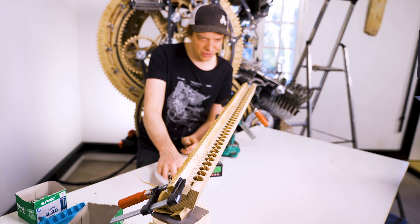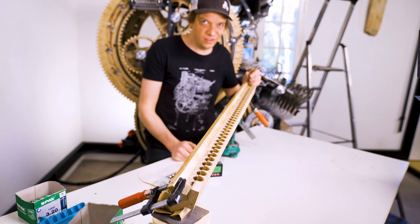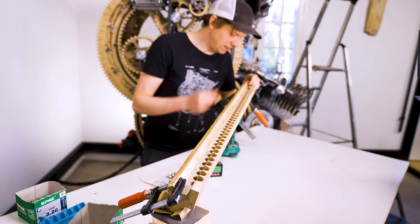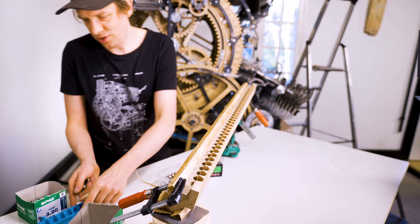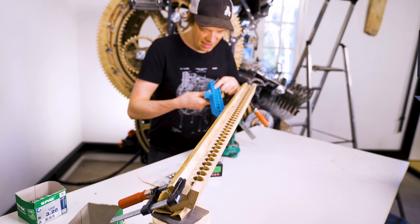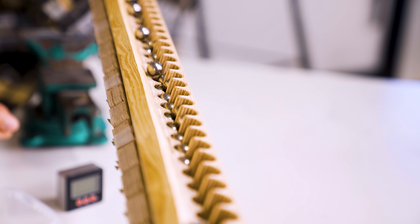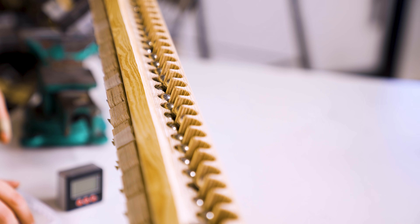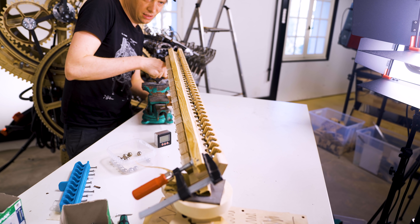At 13 degrees, this feels very good. There's a stubborn hole here — I rounded over this sharp edge. On Rociro's prototype, that edge is knife sharp. The round-over I added creates just a tiny little extra place for the marble to get stuck. They're almost running too fast now, so let's tilt it down a little bit again.